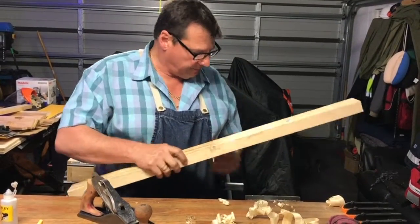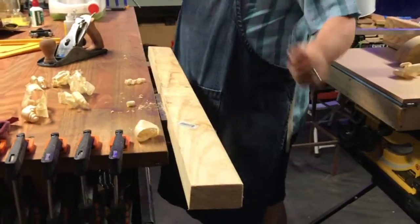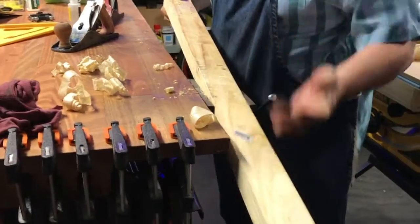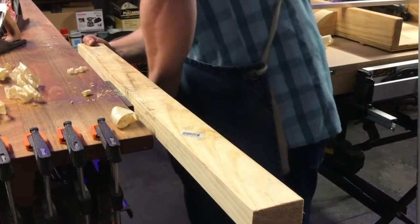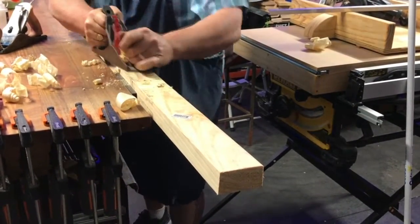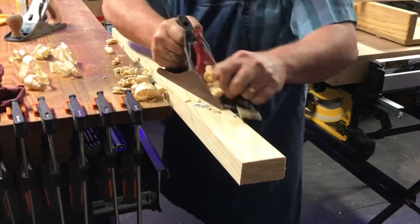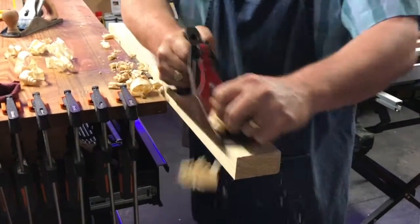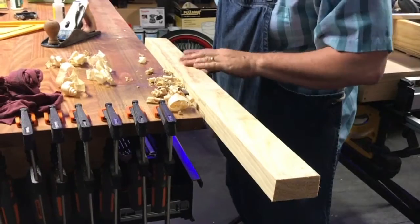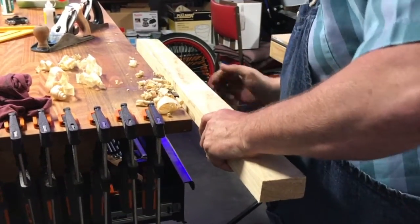Nice. Let's just turn this over — there's a rough edge there. Pretty exciting, this is really good. Here's one we just did up. Just leave the pressure off as you go over the end to avoid chunking. Just turn that over, turn around — see if it's better. I'm still learning how to read the grain on timber.